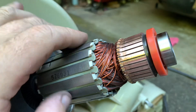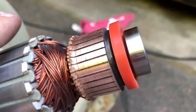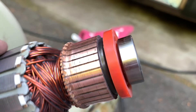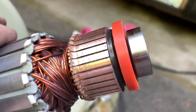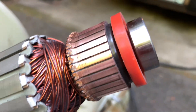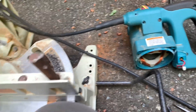So here we go — maybe five more minutes of just really gently polishing it. And it looks like it's in pretty good shape now. It's a question of how the brushes like it. Now I've got to sand the brushes down and then put the thing back together. One hot tip: if this enclosure is resisting you coming off, it's because you need to take the brushes out first.